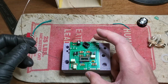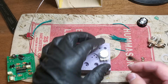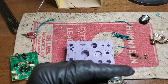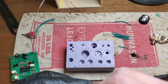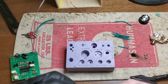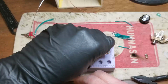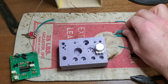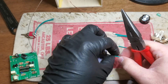And then I learned new things about certain components that I was not properly educated on. That would actually allow me to go back to the original gain boost style of expression control, and possibly even have that be gain compensated, such that it doesn't completely mess up somebody's gain staging in their pedal chain, using a different form of voltage-controlled resistance. That's going to have to be a V3 concern, so there's going to be several of these V2s before I change that around. We're just doing the best we can, you know? What more can you ask for? I don't know when V3 is going to happen.